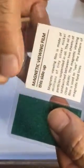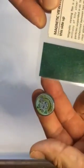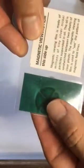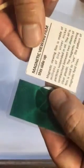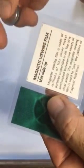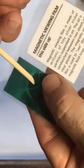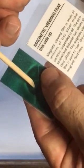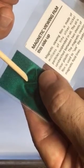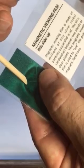The field lines around a quadrupolar magnet are much more complex. This is a QF28-3. At the interpole boundary, the nickel filings are following the magnetic field lines that are now going from one pole to the next alternating pole. So the nickel filings are now lying flat, following those field lines between the pole boundaries.